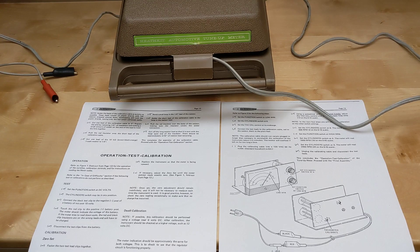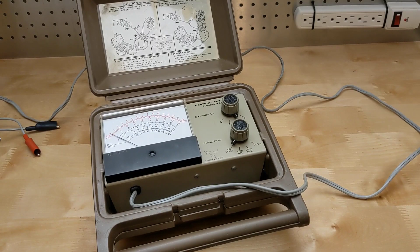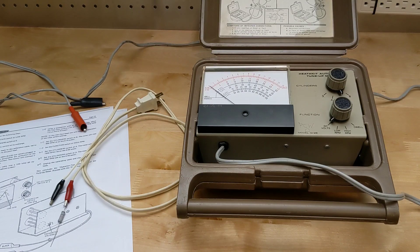The case was in good shape. Some owners reported the cases becoming brittle and breaking after some time, maybe due to exposure to UV light from the sun. There was some minor wear and scratches but it was pretty clean, though it had obviously been used. The front panel was marked or engraved with 'PCW' and some numbers, which I assume are the original owner's initials and social insurance or social security number to identify it if stolen. A visual inspection indicated that all parts looked original and in good shape. I checked the voltage measurement mode with a variable power supply and another accurate meter and it was pretty much bang on. I performed the dwell and tach calibration as per the manual. The original calibration cable was lost, but it only consists of an AC line cord and a 10 kilohm 1 watt resistor, so I made one up on the bench.